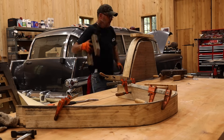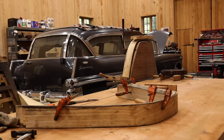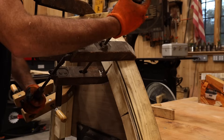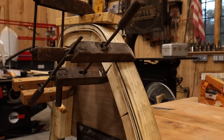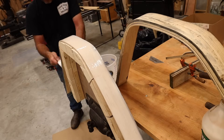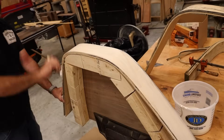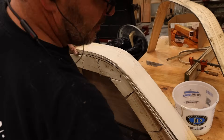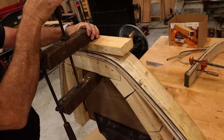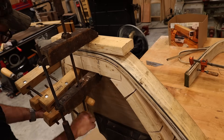And in the back you see my 1957 ambulance hearse, just recently picked up, just working on the radiator there. Making sure everything's nice and tight. Now here I'm gluing together, and I'm using Titebond 3 because Paul Jackman likes Titebond 3. I'm brushing a liberal coat between each one of the layers. Of course, I have to keep them in order — the same order in which I steam-bent them. They must stay in that same order because that's the size they are now. They're in consecutive size order, so it's important to remember how you glue them together.